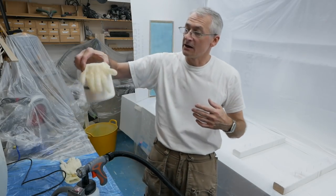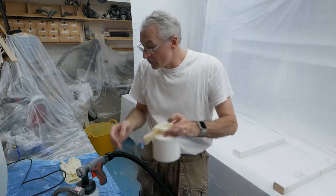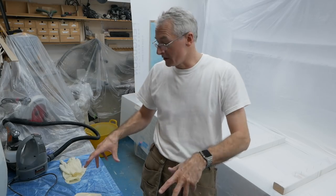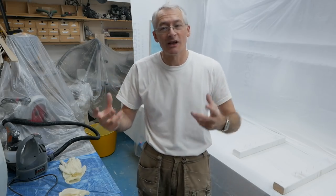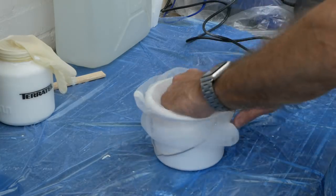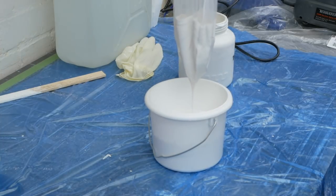The benefit of this one to me is that it comes with two paint pots, which is really handy — if you're doing a lot of primer you can keep a pot of paint on the go and have the other one ready for clean up. One thing you do need to do with HVLP, and with sprayers generally, is to strain your paint, and that's what I'm going to do now. I've got the paint mixed up for the next batch but I want to strain it because clearing blockages in something like this is much more of a hassle than with an airless — with an airless you can just spin the tip around and blast it clear, but you can't do that with this. I'm using a paint strainer from any decorators merchant, straining into a paint kettle then back into the pot — and yes, I did foolishly thin it down first without straining. Rookie mistake.